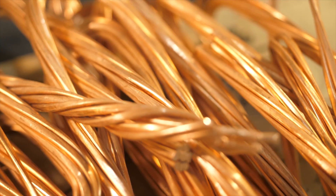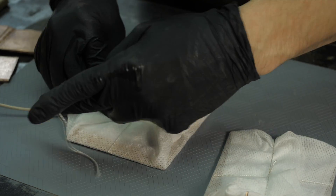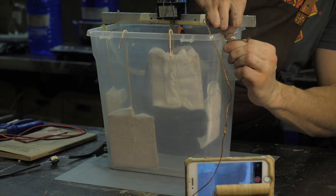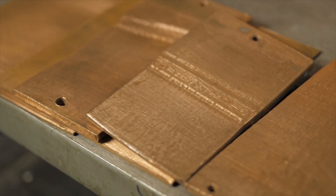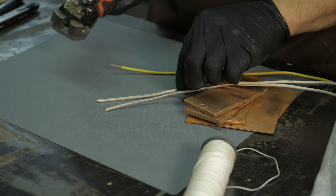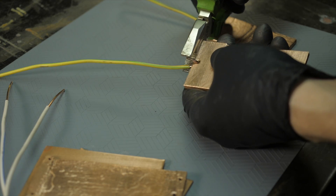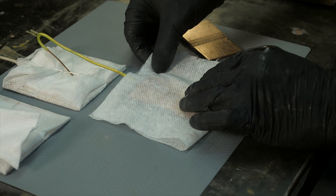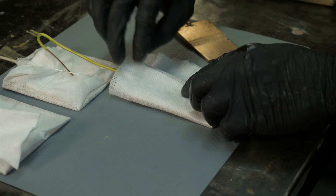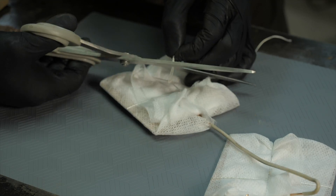In such a case it is better to pack the copper with stainless steel mesh and wrap it with a non-woven fabric filter, so the copper parts will be completely consumed and will not clog the bath. The anode material must be cleaned so as not to contaminate the electrolyte, and make fasteners from copper wire on which the plates will be suspended in the bath. Then pack all the plates in non-woven fabric or coffee filters so that dissolving copper doesn't create any mess.